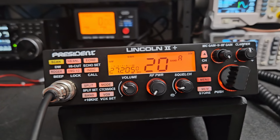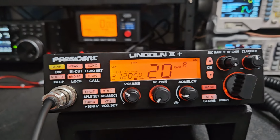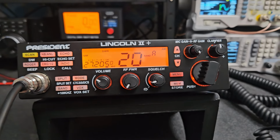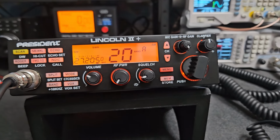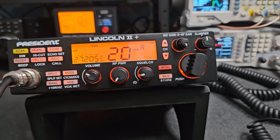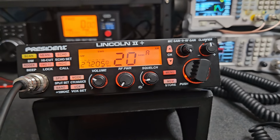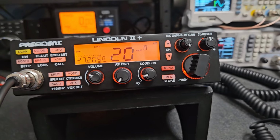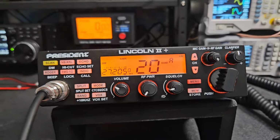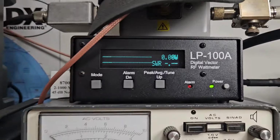Now on AM, again, the same thing would apply. You don't want to swing any more than like 25 in. You can put up to 35 in, you don't need to, though. That's the thing. Just because it says so, you don't need to. The 25 is going to give you a perfect amount. It's also recommended in there not to run it on the top setting on the adjustable output, because you're not gaining any more than what you would by running it one step back. You do gain a little, but it's not going to help you, and that's what they explain. They have a nice detailed booklet that they give you with the device, and it really is helpful to run it the best way.